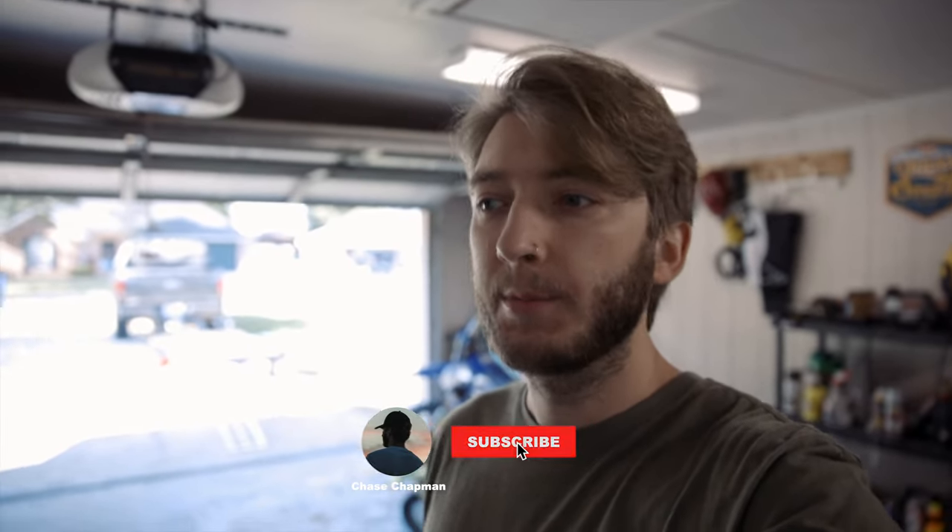Quick update on the bike trailer: yesterday when I went to my parents' house, I got about halfway there — about 30 minutes down the road — and pulled over to check the straps. One of the straps had ripped. Luckily I had put up a safety strap, or my YZ 250F would have been on the side of the interstate. I ended up putting turnbuckles on there to hold the YZ and they worked out really well — super easy to load, takes no time at all, a lot faster and a lot safer than straps.